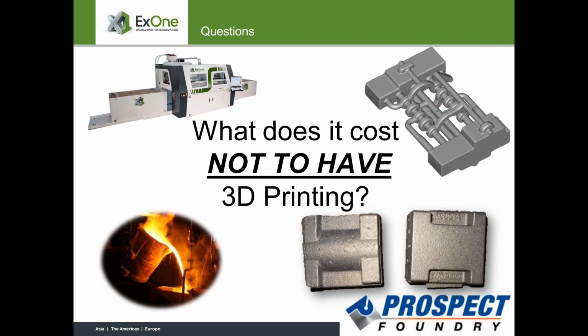Yeah, it's a good point. And like you had indicated earlier, furan is generally not a hygroscopic material where it just wants to suck in moisture, compared to more the silicate type binder systems. So as long as it's, again, a reasonable shop environment, you're going to be fine.